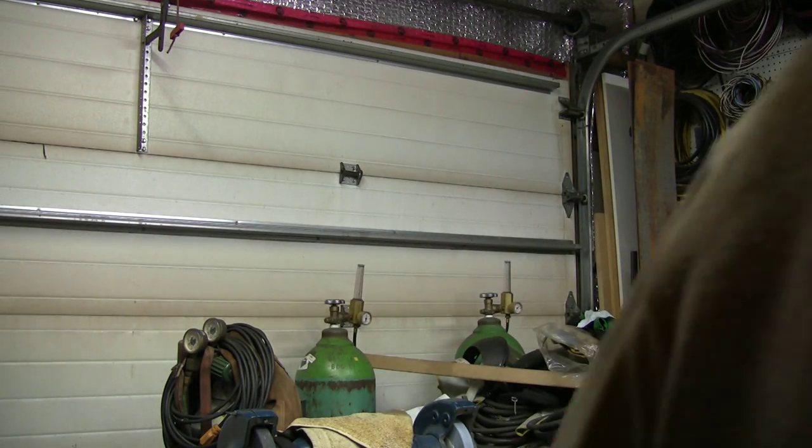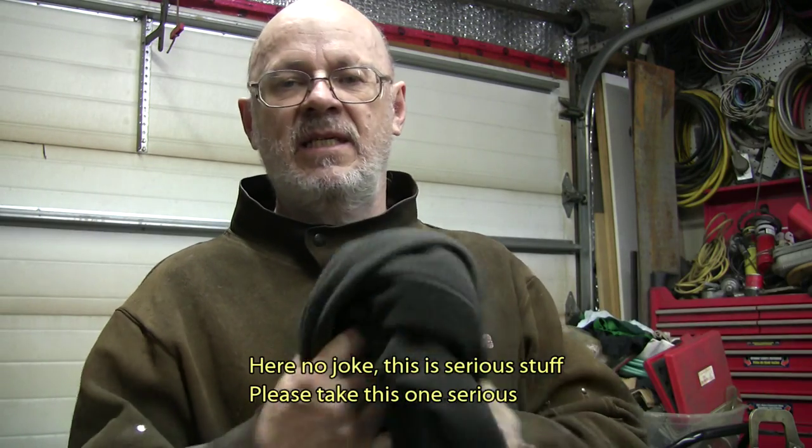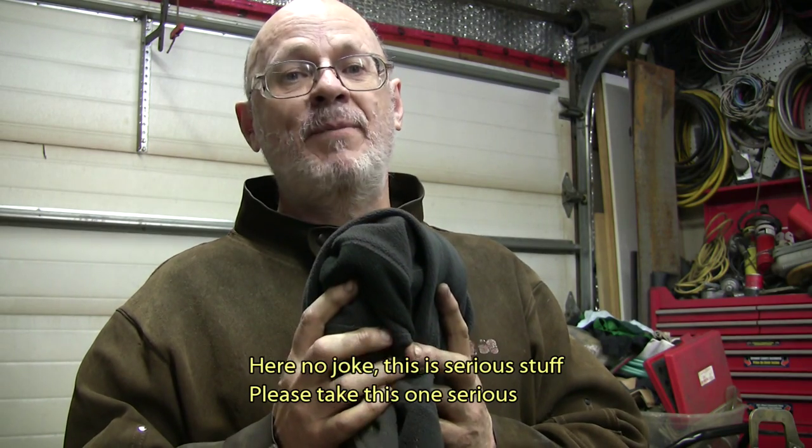They're hot. And also stick welding is the worst, but with MIG, you have little BBs just going around. And what I was wearing before, machining, fleece, synthetic stuff. You never wear that for welding or anything that would involve heat and fire. This material will stick to your skin while burning and really peel off the skin at the same time. So never do that. Cotton will burn, but it won't stick to the skin. It will just make ashes. But this melts.